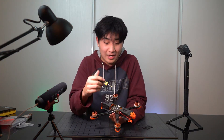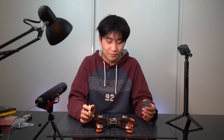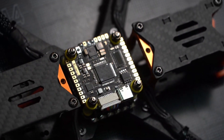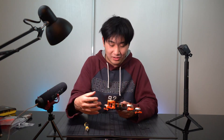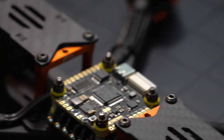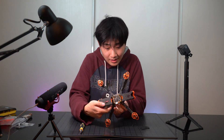Something really unique about this drone is it has a U-bracket design which I've never seen before in the FPV market, and I think that's what makes this mechanism possible to just open it from the middle. Looking at the flight controller, this is an STM32 F722 flight controller — it uses the F7 chip, the most stable F7 chip so far. This flight controller also has a ton of different pins including VBAT, 5V, buzzer support, I2C communication, serial communications, TX and RX, and 5V LED support. Basically everything you need in one tiny package.